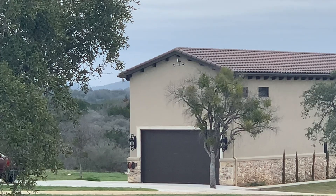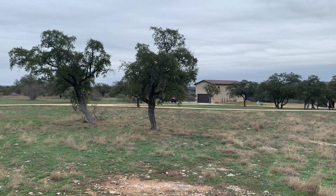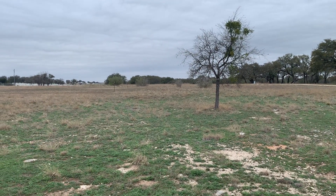There's the master end of the wireless bridge mounted right there at the peak of the building, just under the eave. Now we'll go get the slave put up on a pole down here — just high enough so that the two units can see each other.